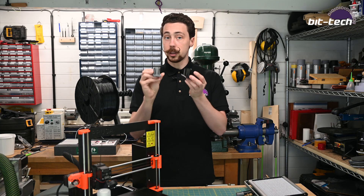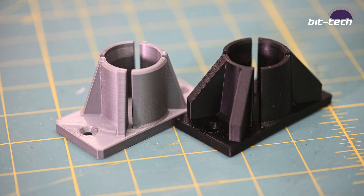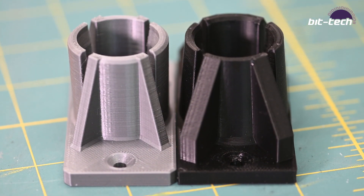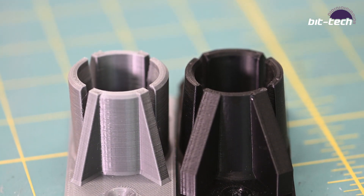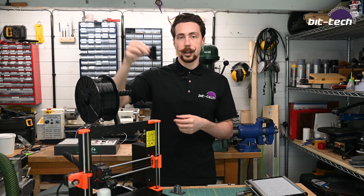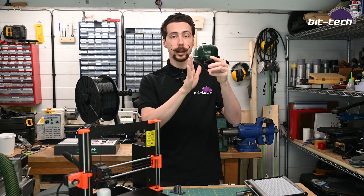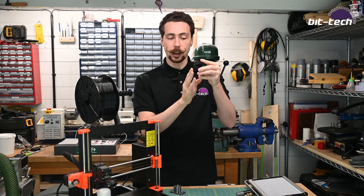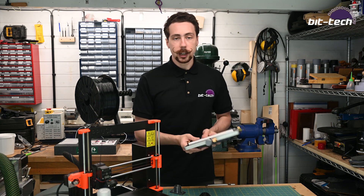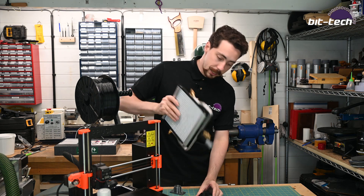Not to be outdone, I tried again with some slightly different settings and came up with this one. Now compared with the PLA print, as you can see this is much beefier. It's the same overall thickness and dimensions, but this one has a slightly shorter top to it, which means it won't wiggle off and down. And it also has much larger, beefier supports. Because primarily these are either going to be held upside down or on their side, these top and bottom surfaces are going to be quite load-bearing, and I want them to be nice and strong. Whilst I can use this PLA surface for the male connector fine, if I put it in...